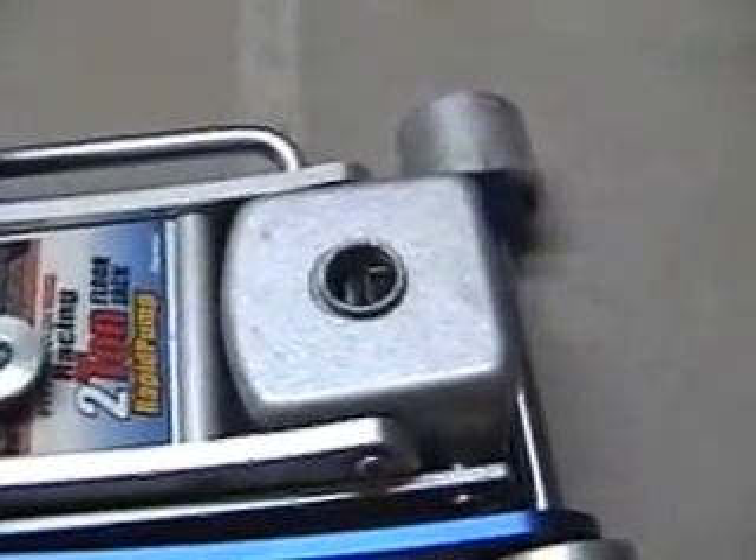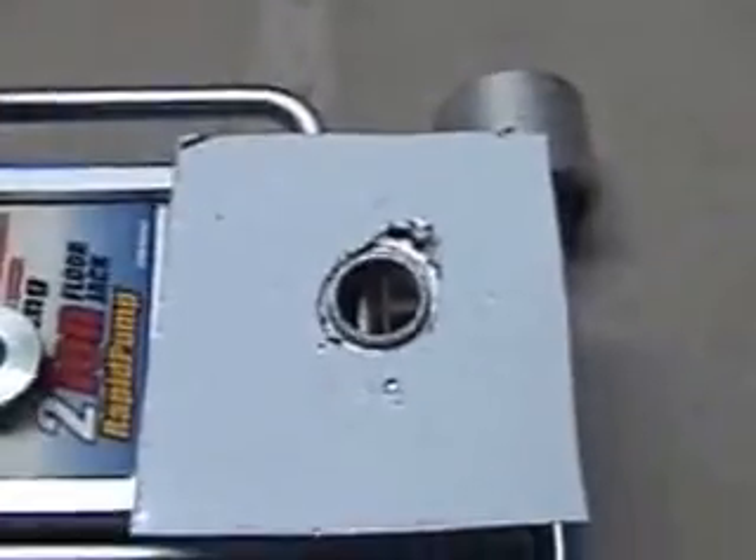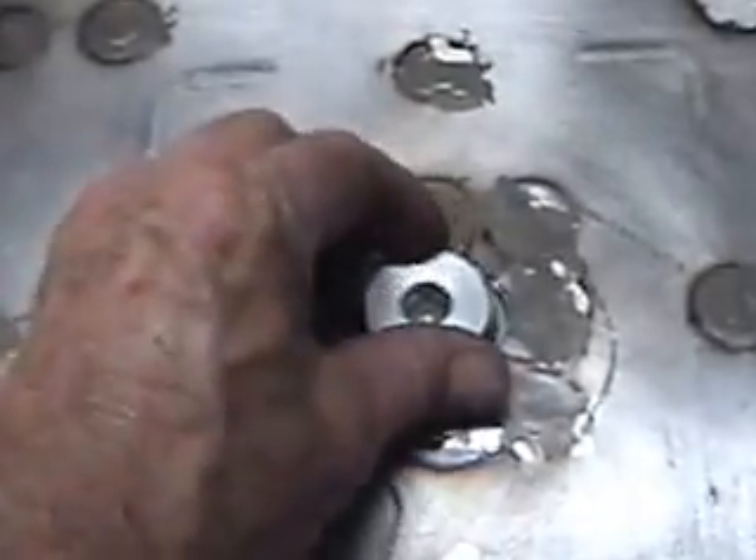There's the finished plate, all ground and ready to go. Something I wasn't counting on — there's a 32 thousandths lift I've got to put here, so I went ahead and made this up real quick. It's 32 thousandths aluminum. I'll put that on, put the screw on, and tighten it up with your 10 millimeter Allen wrench — nice and snug. Lower this a bit, it drops down, and here we go — right up underneath there.